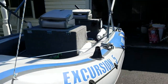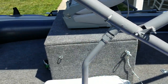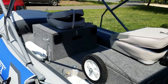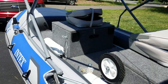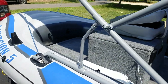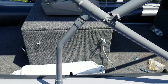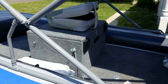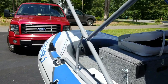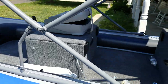And then the front rope is on here. For these side pieces, again this is half inch PVC. All I did was take a heat gun and heated it up for about a minute or so, put it inside of a vise, and bent it while it was soft. That's how I got that elbow right there. I tried to use a 45 degree PVC elbow, but it was too sharp of an angle, so I'd say it's probably around 30 degrees or something like that.